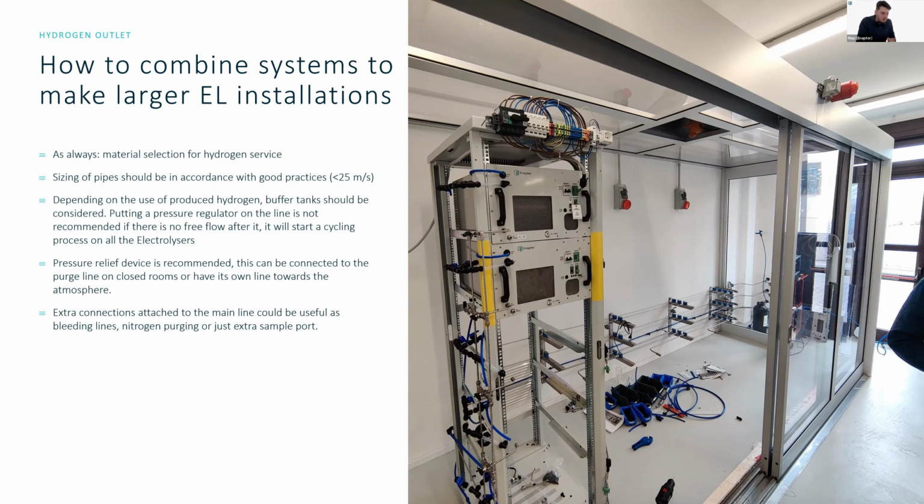How you do the rest of the complete system maintenance again depends absolutely on the rigor of the installation. So some people will perform some sort of hazard reduction due to the frequency of the maintenance visits from trained professionals. Other people will have more access to the systems and then be able to say, okay, we only do this check once a year, but we have access to the systems and we monitor the hydrogen concentrations at all times, etc. And then there are places where, for example, certain components may have to be replaced on an interval that's based on some sort of local rules and regulations. And this may change literally country to country, even within Europe. So safety relief valves or something like this, you should check your local rules and regulations for this. And it of course depends a little bit on your HAZOP and risk assessment of the installation.